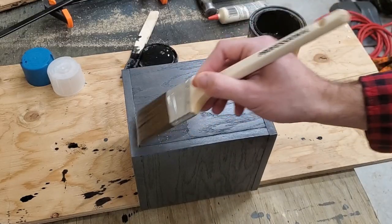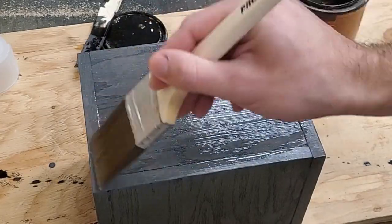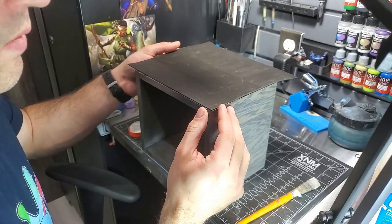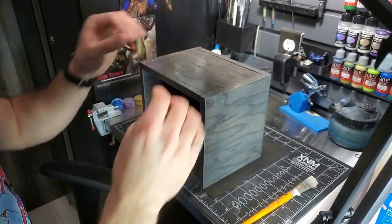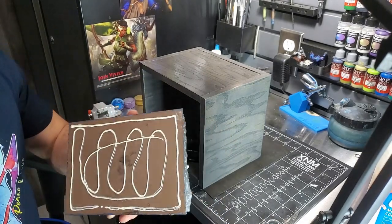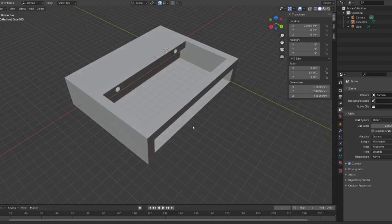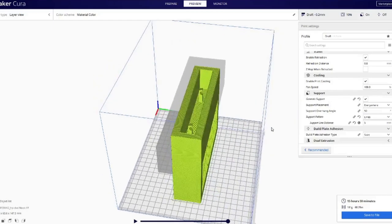Once that was done, it's the polyurethane clear coat — same process, very thin light coats. Don't worry about some of the bubbles, this will all settle out with gravity. Make sure you leave it to dry in a warm place. For the bottom I put a nice piece of soft foam core so it wouldn't slide around on furniture, glued on with some Elmer's white glue. Then some carpenter glue and it was time to put Hogwarts on the top. Then I went into Blender and drafted up a spacer for the bottom with holes to wire some LEDs — my plan was for this to hold the Elder Wand and light it up from the bottom of the box.